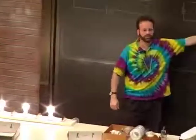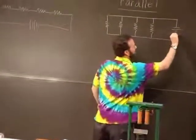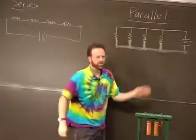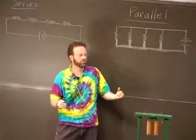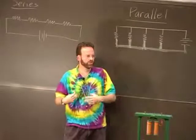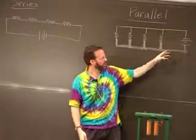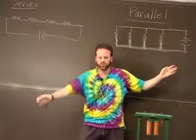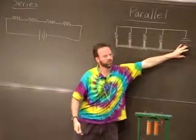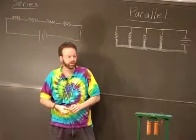Here we don't. And that one, I like drawing it like this. This side of the battery, where I shaded, it all has the same potential. Same amount of energy per charge, same voltage. Those are all the same thing: energy per charge, voltage, electric potential. Because ideally, if it hasn't used up in the wires, which it usually doesn't, it's minimal, then we haven't done any work. We haven't expended any energy along the path I shaded. We haven't gone through anything to expend the work, the energy.